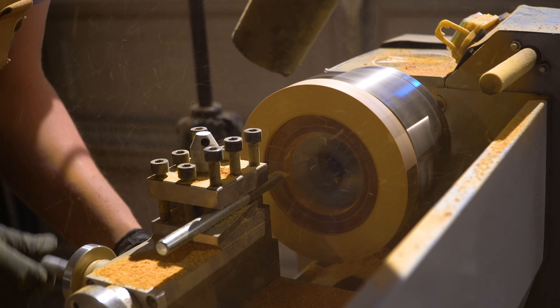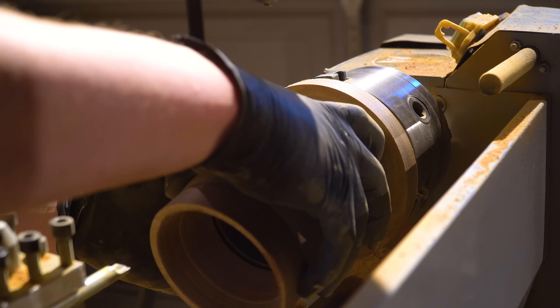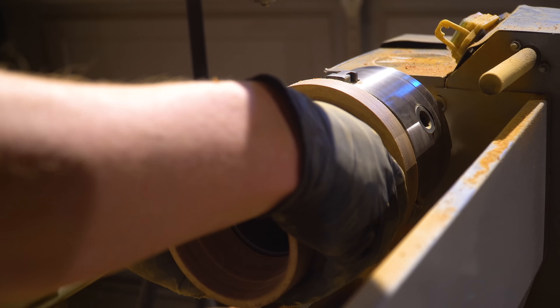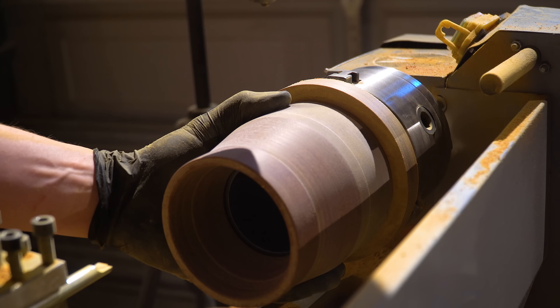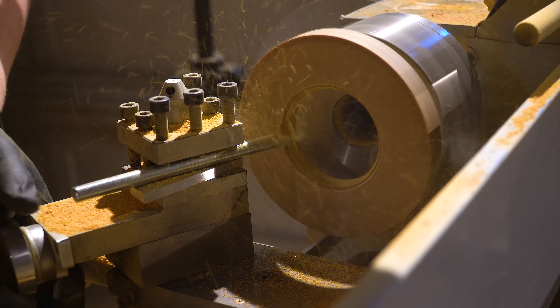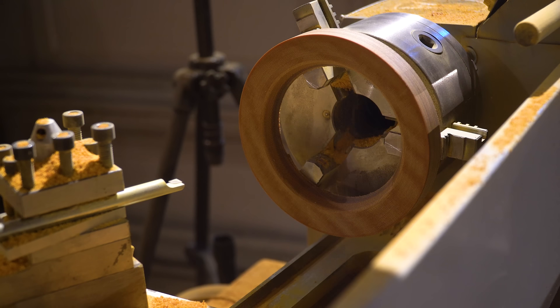The top insulator part was fairly simple. First I turned the inside lip that fits over the graphite insert. As I went, I checked dimensions against the CAD file, but most importantly against the actual parts. When you have something like this that's a one-off production, it's good to start by following the CAD, but as the part builds up, it's better to follow what the part actually needs, because tolerance errors can stack up. I then used my newer, slightly stronger boring bar to turn the top taper, and once that was done, all of our phenolic parts were finished.